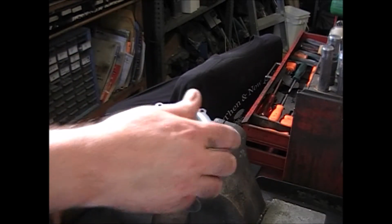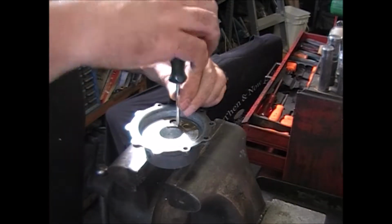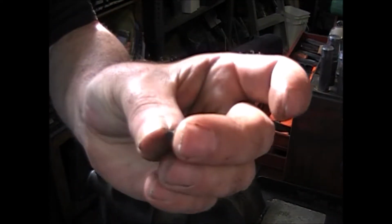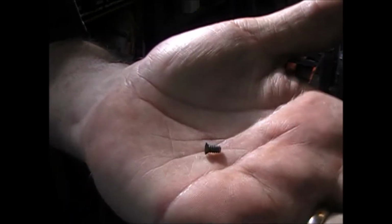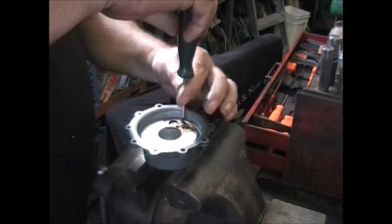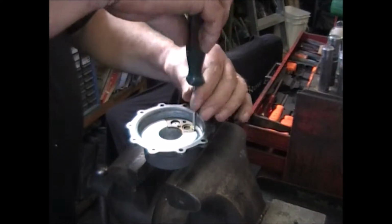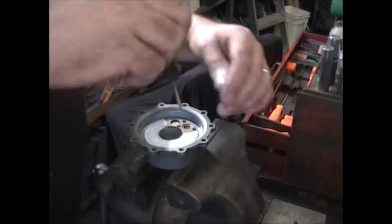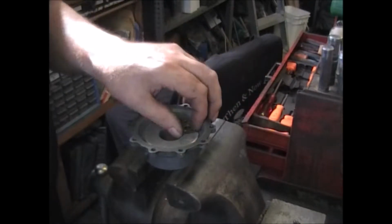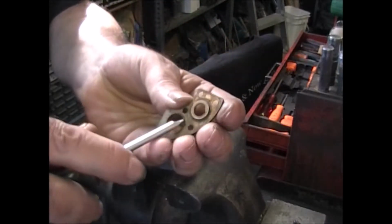Let's take out the valves for the vacuum side. You need a pretty small screwdriver for this. There's 4 screws that hold it down. You can see they're so tiny. Don't drop them. As you know, there's a little animal down on the floor that'll pick it up and run with it. And you won't see it. After those 4 screws come out, that's the seat for the valve.